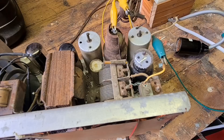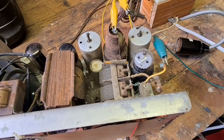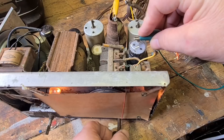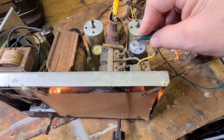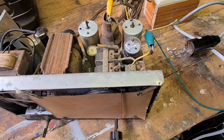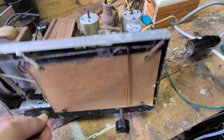I'll turn it up. I won't hear much because it doesn't have an antenna and the grid cap's off, but it's getting through. If I hold that there and tune around... there it is! It's not very loud, but pretty amazing — most of these radios work. The audio is garbled, so the coupling capacitor is shot in it. I'll turn it off. I might use that 6V6 valve if it's any good.